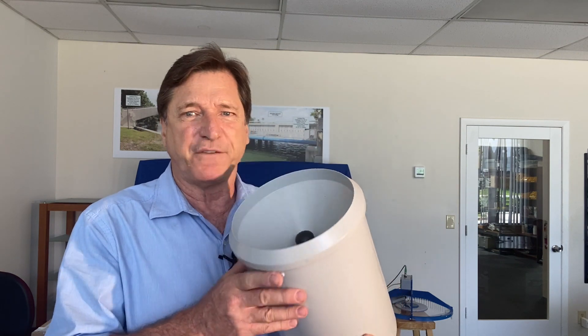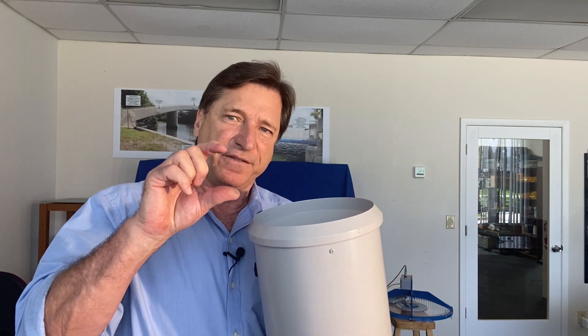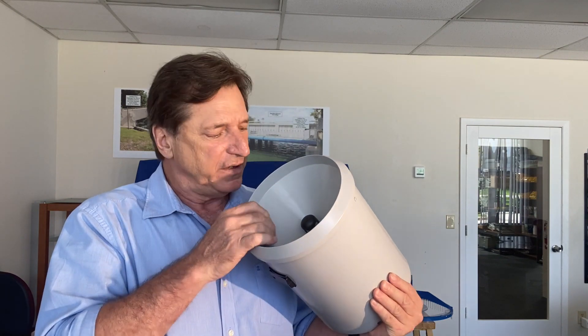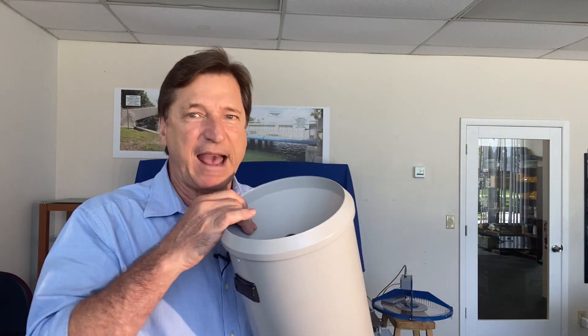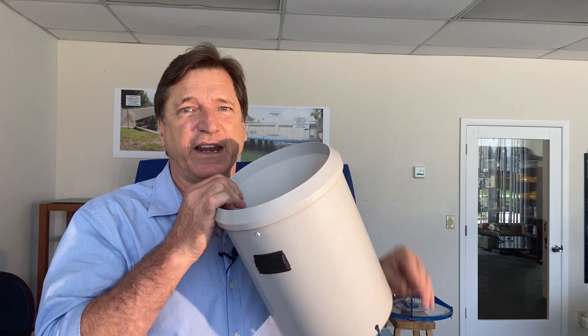What we have here is a vertical finger filter assembly — about two and a half to three inches tall. If there is airborne debris blown into the gauge or bird droppings, it will actually sit at the bottom, form a false bottom, but it will not impede the entry of rainfall. This is a really important feature. The finger filter is very easily removed for servicing, and when I take this out, you'll see that what is attached to it is the actual flow control device.